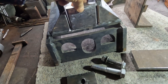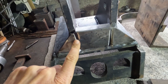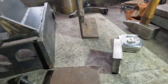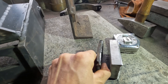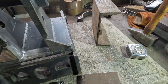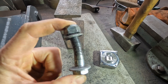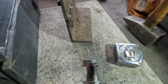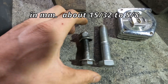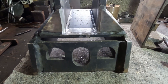It's going to come in right there and be welded off in the grooves that were pre-made here, then a hole drilled through it. It's a little bit sturdier — almost more than double. The bolt completely bent; this was the one that was in it. We're going to replace it: the old one was a 12, this new one is a 16.